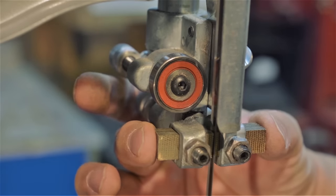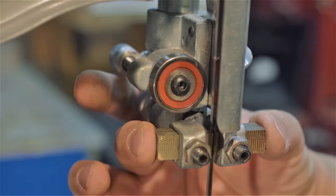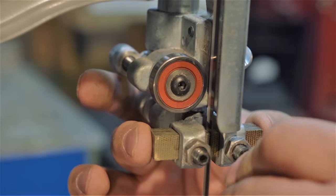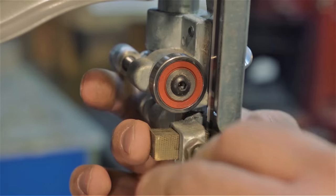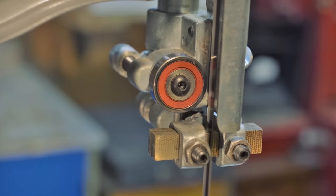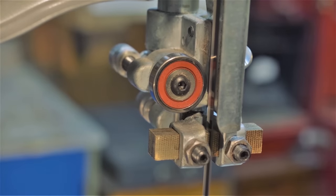Keep the blocks firmly squeezed together and move the blade from side to side while it's running. What we're looking for here is a natural running position, or a position of least friction, where the saw is the most comfortable. Once you've found that, basically by listening to it, tighten down the set screws. Even when rubbing tightly, I've never had a blade even get warm to the touch with cool blocks.